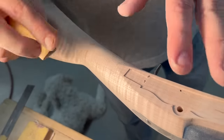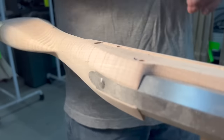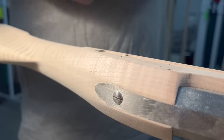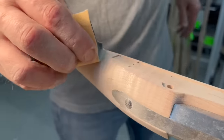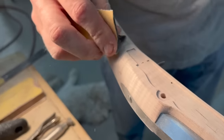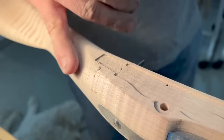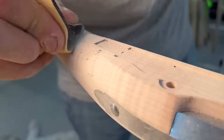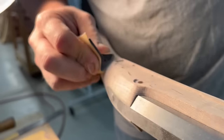And you can see they're not hollowed out a lot. Rarely do you see a lock panel that's heavily hollowed out. On some percussion guns, you might see that a little bit more. But the tendency of people that are just beginning is to try to define the lock panel more by using some kind of a round file or a half round file and really trying to cut it out. But it's really not how a gun, at least of this period, should be shaped.